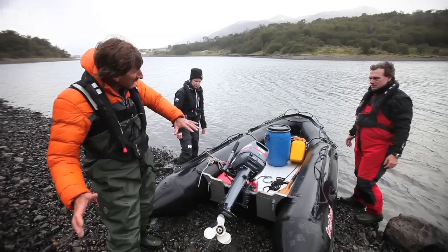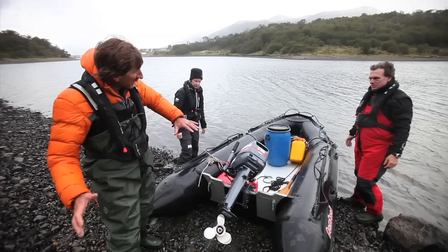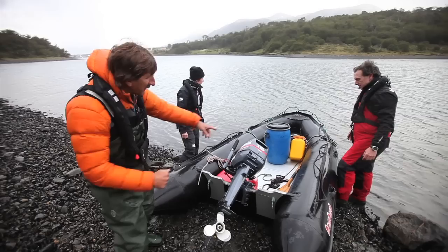If this was a big surf landing — sometimes you do have to come in in surf conditions — you'd want to turn the boat around, bow out. Because if you went stern out, you'd be flooding the boat and it'd be full of water. So we want to shove the boat straight out. I may even run the engine dry for about 10 to 15 seconds, so when you do get out there, it's one pull and you're away.